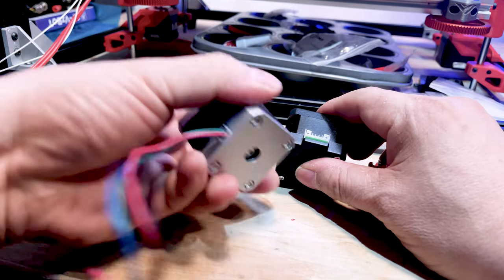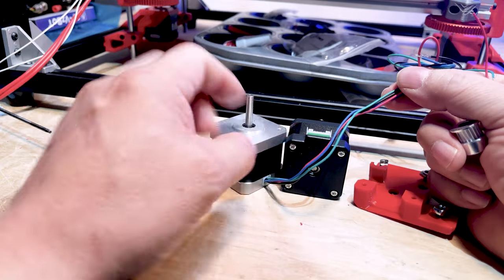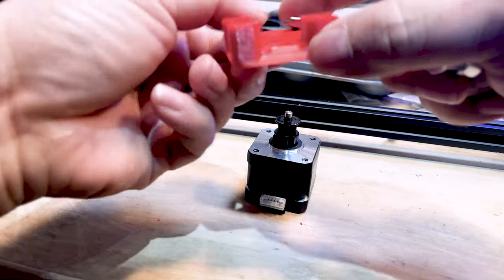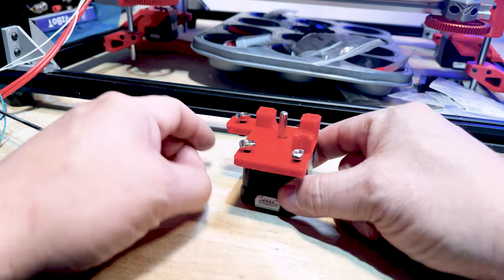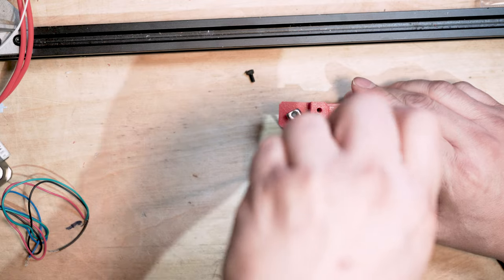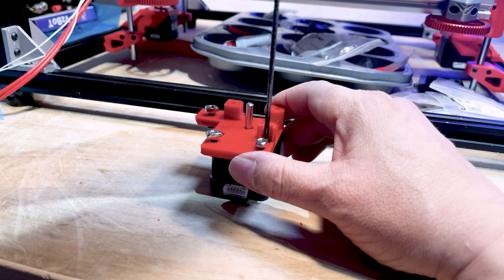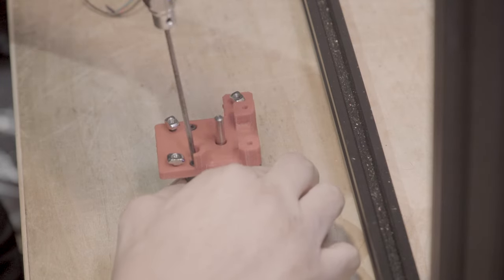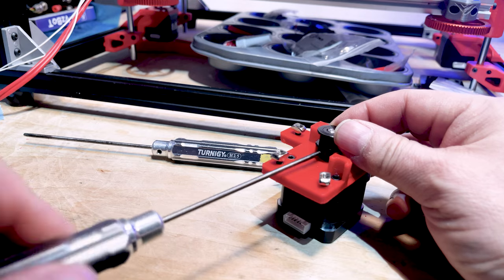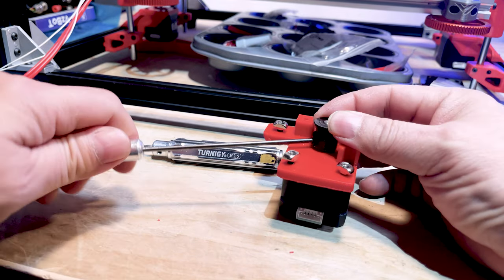I hate the motor with wires because if I have to manage those wires I have to use shrink tubing and it looks ugly. With a ribbon cable I can make a nice custom-length cable, and if something goes wrong I can swap it out. To assemble: put the two screws on top first, then secure this piece to the underside of the top frame extrusions so you can place them correctly — if you screw the pieces together first you can't do that. Then put your pulley in. I have concerns that these grub-nut gears can introduce wobble because they're so loose.